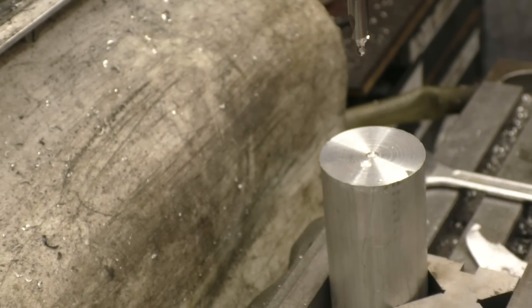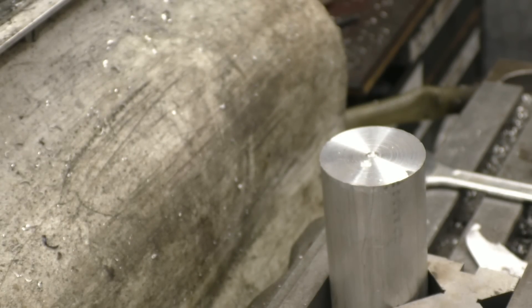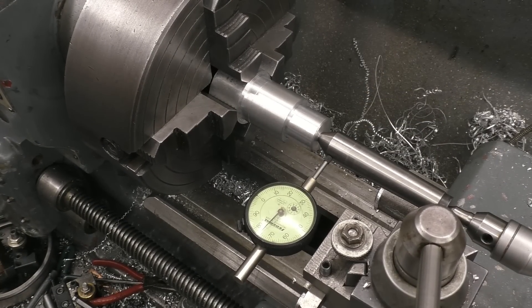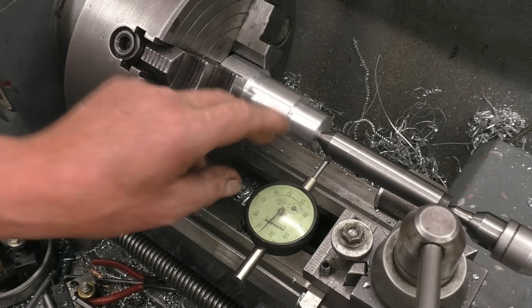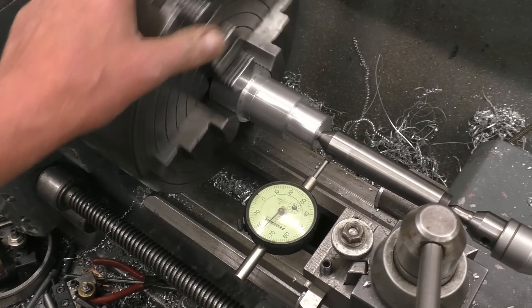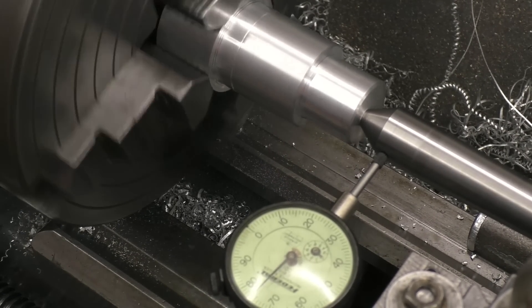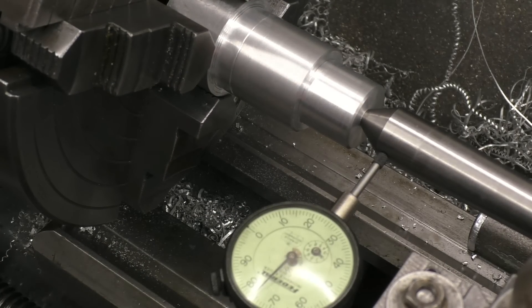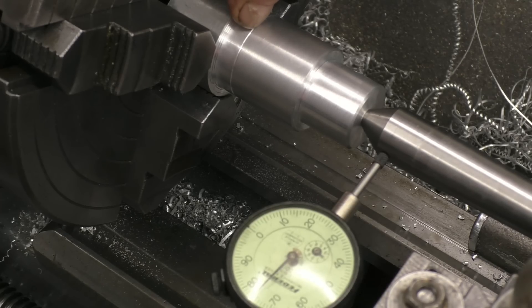I'm going to carry on and drill it on here and put it in the four-jaw chuck — it doesn't make a great amount of difference because the milling machine does run nice and true. Right, four-jaw chuck. Unfortunately I've lost a bit of video — the stage I'm up to is I've finish-machined it to size and I've set up the four-jaw chuck on the offset ready to drill the hole. I'll zoom in a little bit so you can see the gauge — make sure that's within a thou or so — that's pretty good. So I've got to drill the hole in there, same with the other one, then I can put them in a three-jaw chuck, grip there, and just machine that end. I've got a marker here where I know the length has got to be.